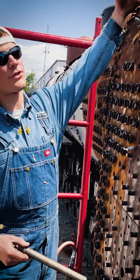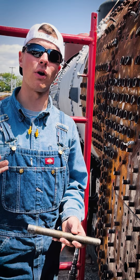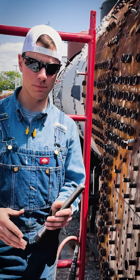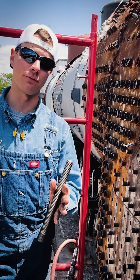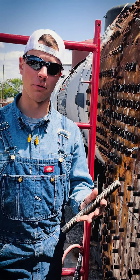The entire boiler is surrounded in the firebox section with either radial, flexible, or crown stay bolts. The stay bolts prevent the inside and the outside sheets from exploding out because of the great pressure on the inside, created by the steam and water when they're boiling.